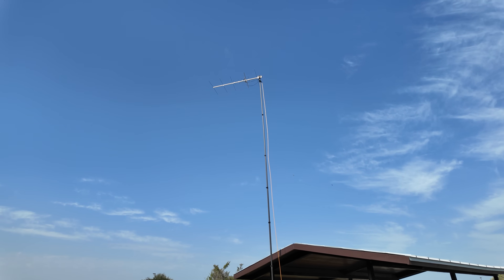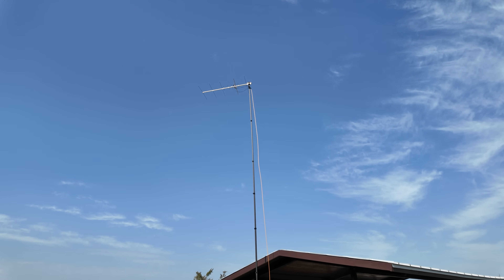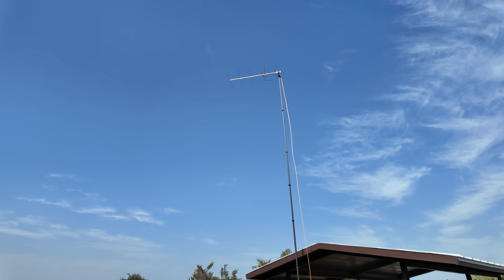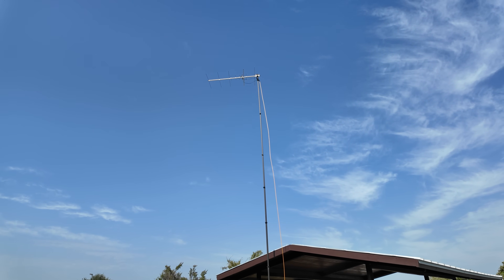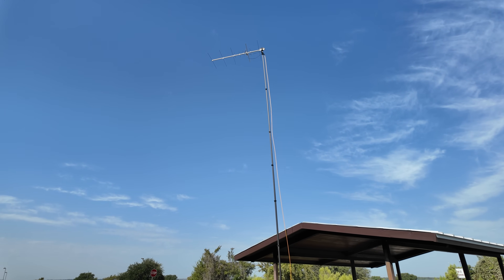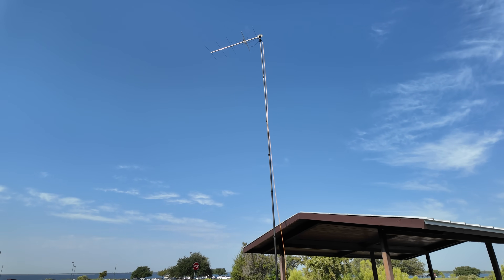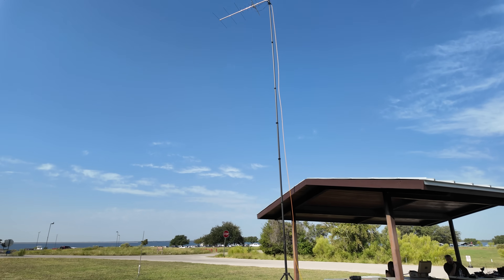There's a high Q on this Yagi antenna and it's basically pointed south right now. We're at Lake Ray Roberts State Park, which is a little bit northeast of Denton. If you look on the map, we're almost exactly due north of mid-cities between Dallas and Fort Worth. So I figure if I point south, I've got a semi-good chance of working somebody. I sent an email to a couple of people I know — get on 2-meter sideband, 144.200, and see if you can work me out here.